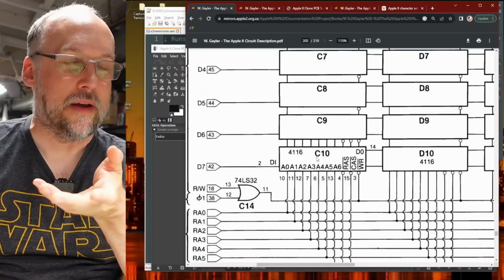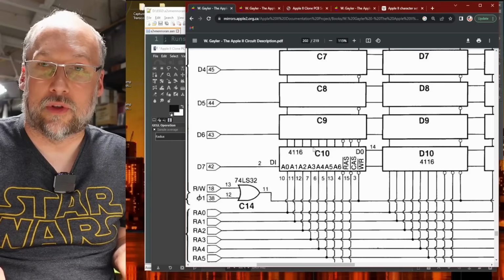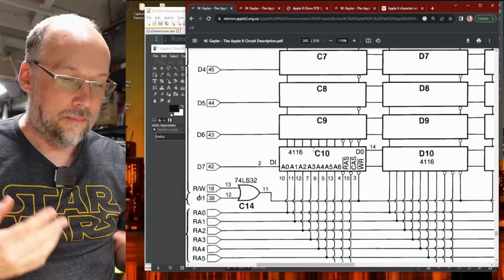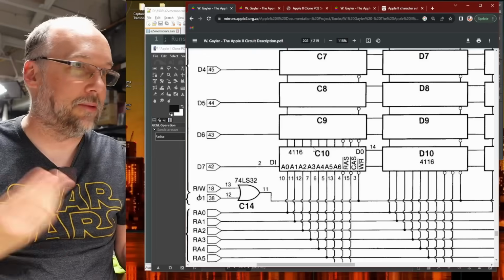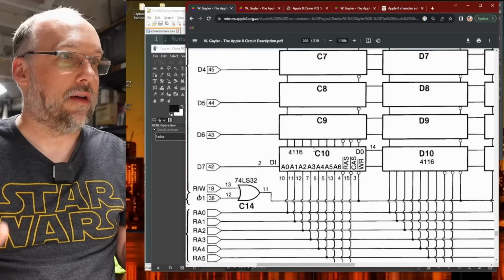And I think at this point, I'm just going to have to scour over the schematics here and look for any chips that have both of those together. And then there might be a similar situation where the traces are too close to each other, because it's kind of unlikely that a chip itself could cause such a dead short like that, but I guess anything is possible. So I need to first find where on the board that chip might exist and see if we can figure out the problem.